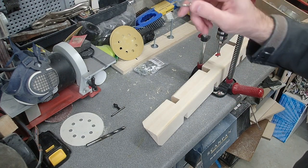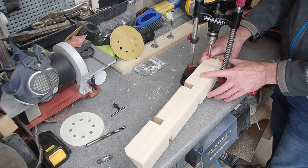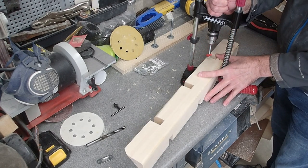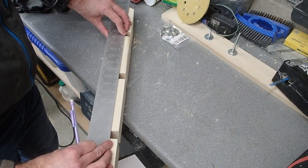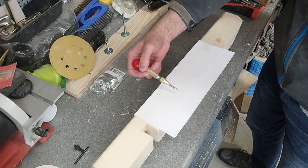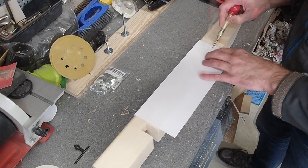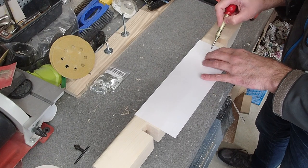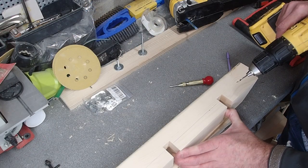It's time to mark up where the keyhole fastening devices are going to go. I put it in a drill press against the edge and mark it by pushing down, doing the same again, then marking from point to point. I tape a piece of paper on here with scotch tape — there's a faint pencil line visible through it — and I use an awl to mark on that line where I want to put the holes, two on each side. Then I use a small drill bit for centering later on.